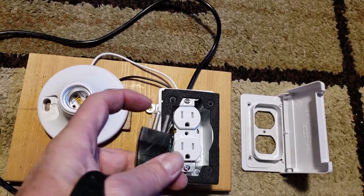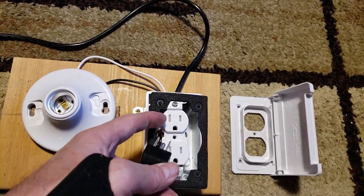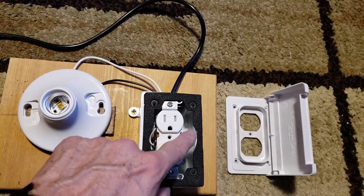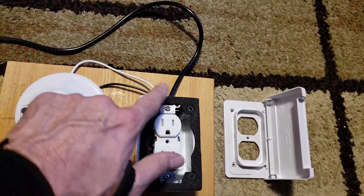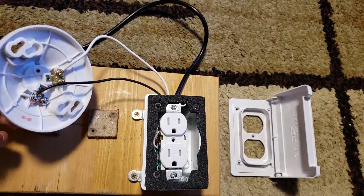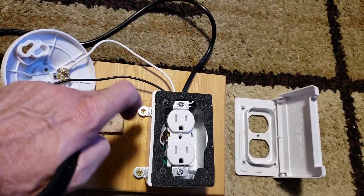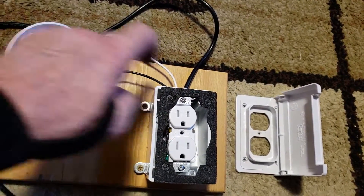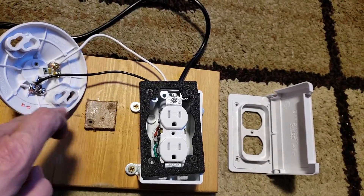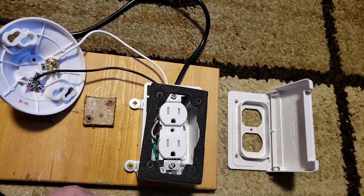You have to test all of those things — that would be this pin right here. You do a continuity test, make sure you've got the right color wires going to the right place. It comes into the side here, and then I just kept it with white going out into the bottom of that, and then basically after it goes through the load — which is the light bulb — I turn it black. So basically the circuit comes in and off to the races as you go.